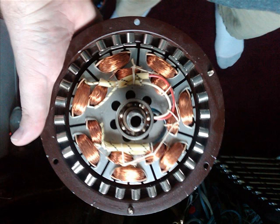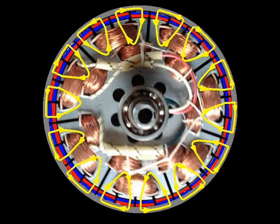These magnets close the air gap between the magnets and the stator by one half. When you close the gap by half, the magnetic flux is about four times stronger, so closing the gap is more important than using more magnet. Setting a ring behind the magnets for the magnetic flux to travel easier helps to use less magnets and increase the flow of magnetic flux. Just like the flow of electricity, magnetism needs to flow in a full circular path to work well.